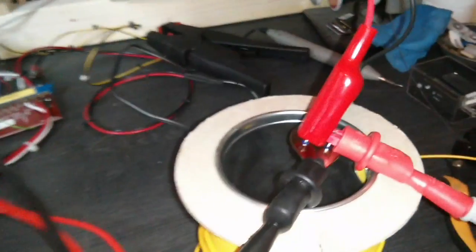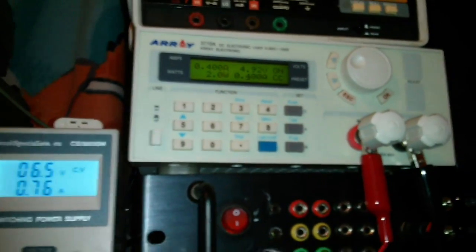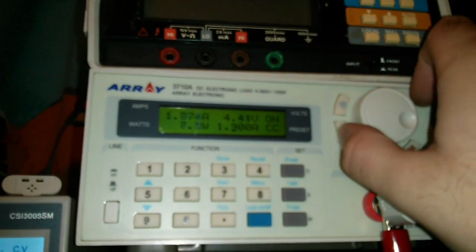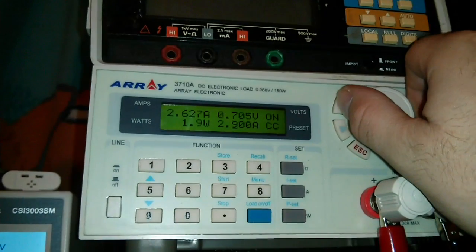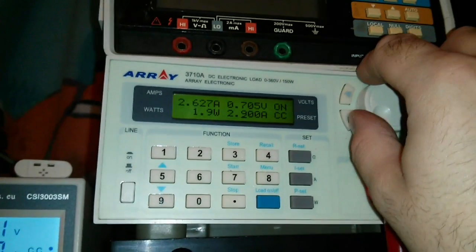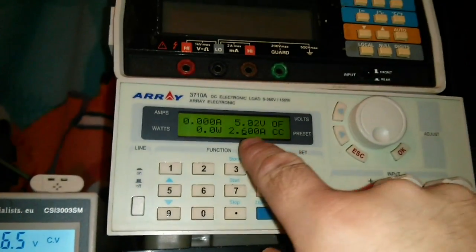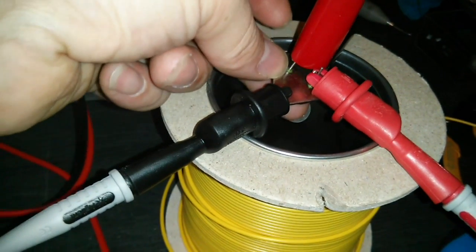What I'm going to do, actually, is grab a couple of other devices and compare them - see what they do. So we've got a second device wired up. No load voltage is at 5.01. Load on. We've got half an amp. We'll just give it a quick crank up. It performs exactly the same. So at 2.5 amps it's around 4 volts, and then as you get to about 2.7, 2.8, it completely cuts out. And again, it's got fairly warm.